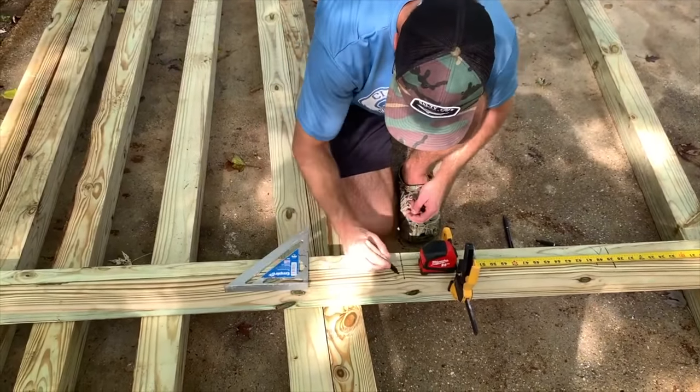And then I'm taking my 21.5-inch jack studs and positioning them in place between the window. Then I put in my header, and then I'm actually taking the shed window that I purchased previously and making sure that I'm okay with how it lines up within that rough opening.